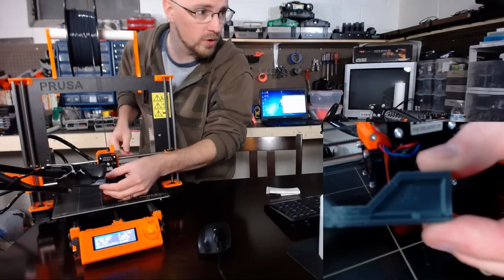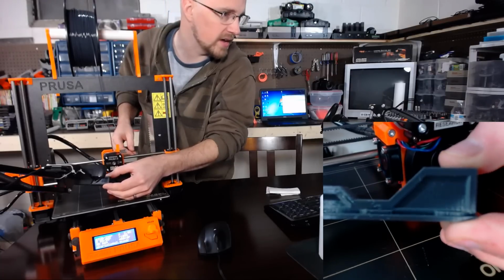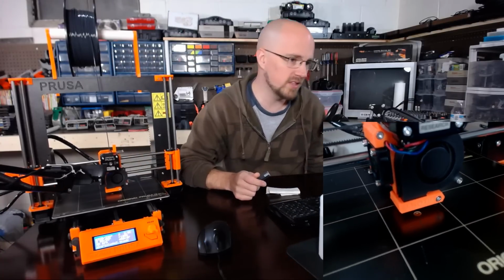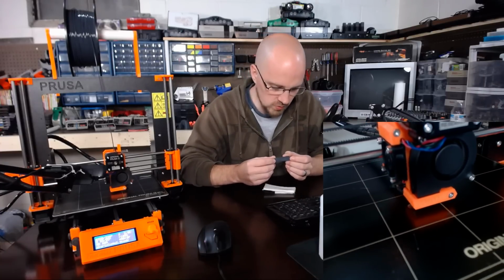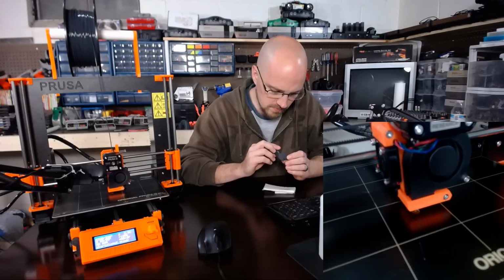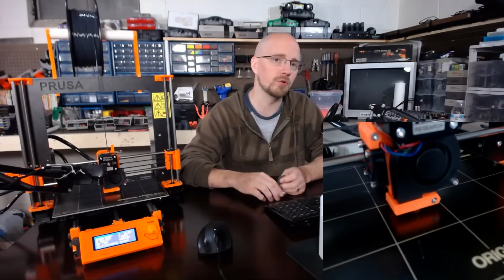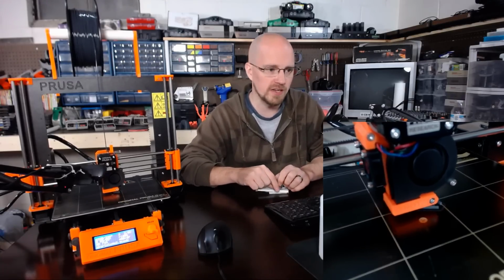This is one. I don't know if you can see in the center of that cavity there, there's tiny little bumps, and I'm not sure. At this point, I should know what's wrong with that. I think that's where my layers are starting, and it's more than likely a cooling problem, or 220 might be a few degrees too hot. I might come down to like 217 or something.